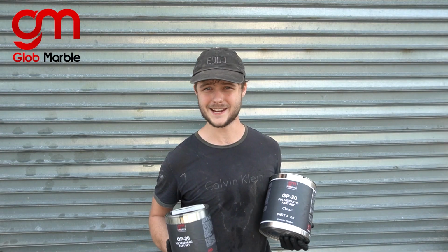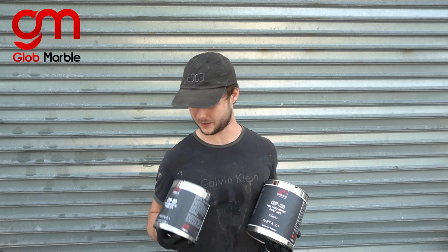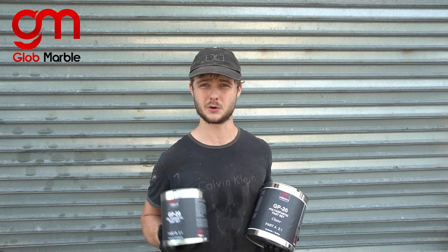Hey, I'm Vlad with Glow Marble, and epoxy flake floors take about 2 days after all the preparation to apply the floor. We found a way to do it in only one by entirely cutting the epoxy out of the equation. Instead, today we're going to be using only polyaspartic. Our product is GP20, it's a 2-to-1 ratio.